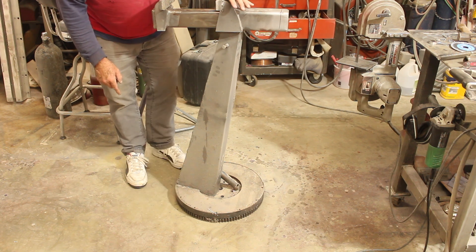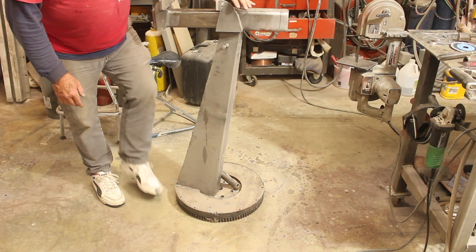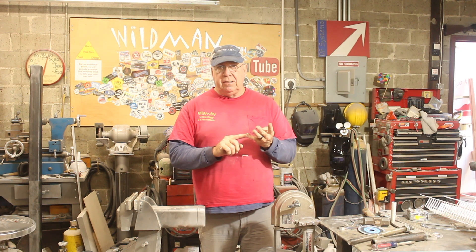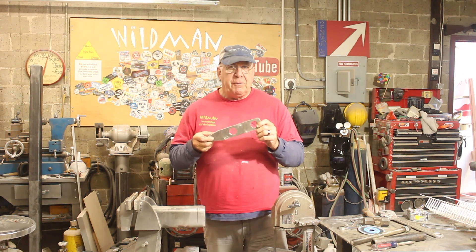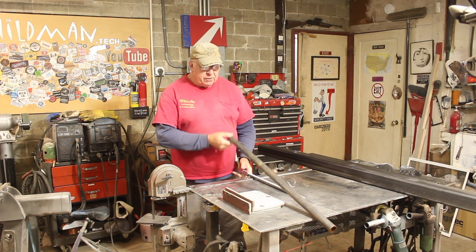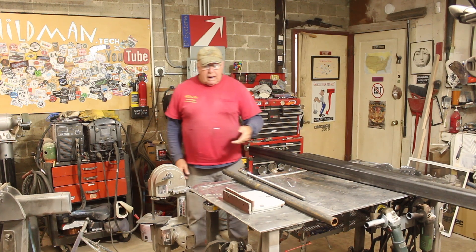But this semi truck flywheel as a base didn't work out so well — between the recessed area and the ridge it just collects dirt. We're going to replace that with a piece of half-inch plate steel. So: new vice body, new dynamic jaw, stronger screw, bigger base. Also, my speed handle wasn't tight — it flopped around — so we're going to tighten up the fit and install spring-loaded ball detents so it snaps into place. We've got our threaded rod, coupling nuts, tubes for the body and dynamic jaw, and some plate steel.